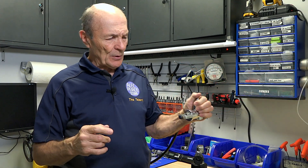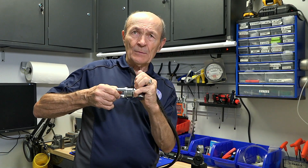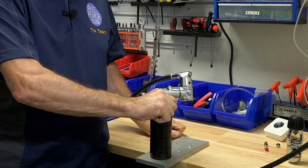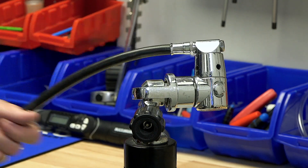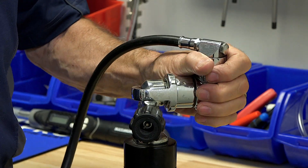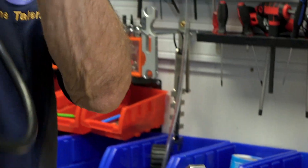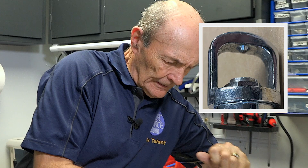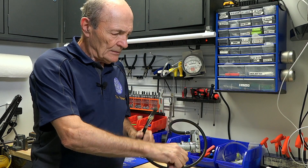It was kind of nice in some ways. So how do you put it on a tank? Well, it's really very simple. You see how this mechanism — this part — pulls out. It's spring-loaded. So you put this on the top of your tank and you pull it out like so; it snaps down in place and turns on the air. That's that easy. It's a pneumatic yoke on it. You just put it on and turn the air on. Now it's on there tightly — I can't get it off. I'll turn the air pressure off. To get it off, I just pull on it and lift. Off it comes, like that. There's a little dimple inside there — that little dimple right there — that goes into the hole on the back of the valve. You pull it over like so, and it's on. Turn the air on. Pretty neat, huh?